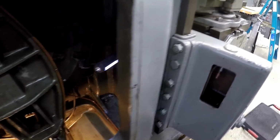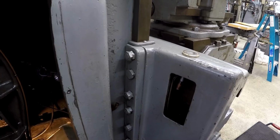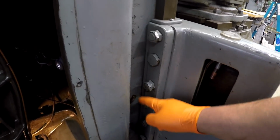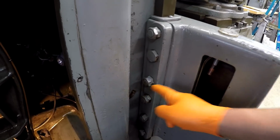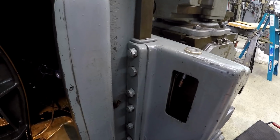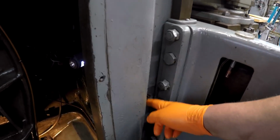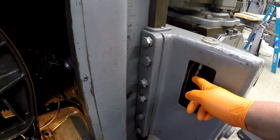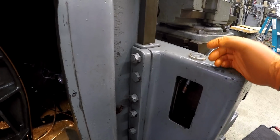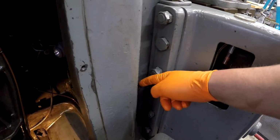So one more oiling issue that I'm going to have to deal with again, and this may come up in other places of the machine. Remember, I hooked a hose from here to here, and there was actually another smaller hose that was going in between us again. I believe it was like a double hose system, and what I think is going on is that oil is coming up through the small hose to oil, and then everything that's left over, the bypass, is going back through the larger part of this tube down into here.